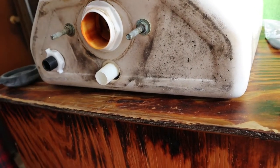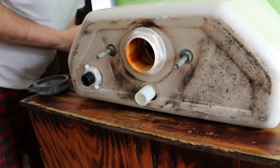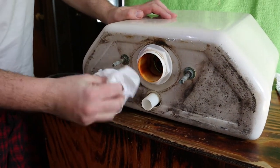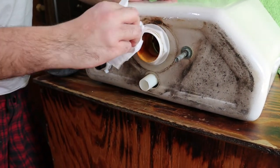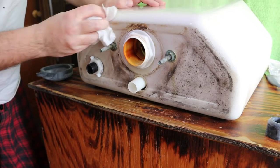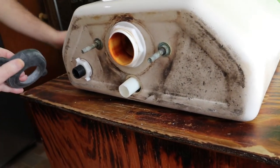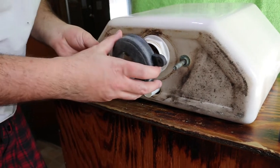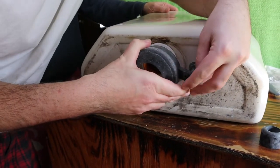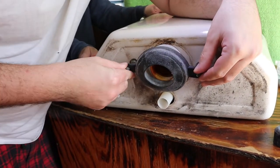You may not see this setup on your tank where you've got a washer and nut - I learned that from a plumber years ago. Most tanks just have the bolts going through and the bottom nuts attach to the bowl to keep the gaskets from leaking. He showed me a way to keep them from ever leaking. John, you can wipe it off - just a little bit down there. Now John, you put this on - just slip it over the bowl holes like this, work it down. Get one started a little bit, push down, then get the other one. Of course it goes with the cone down.